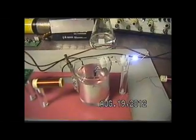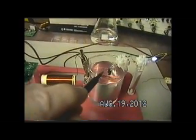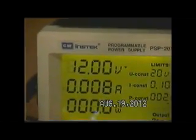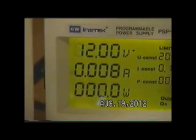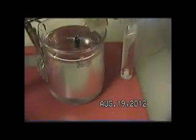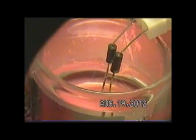You can see this white lead is on. Connected to that lead are the two diodes, the capacitor across the LED, and the two electrodes down here in the water. The exciter is functioning now. Looking at the power supply: we're showing 12 volts. As the electrolysis begins, we started out at 10 or 11 milliamps and have dropped down to 8. Let's zoom in and see if we have electrolysis already — and sure enough, it's starting. We'll let that get established for a few seconds.